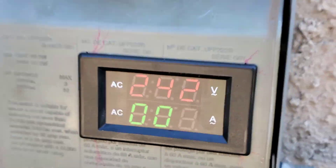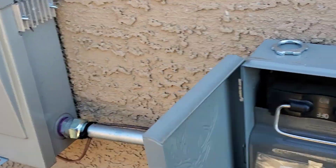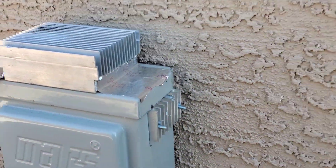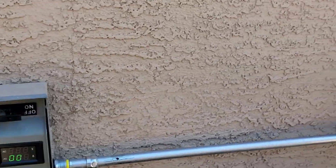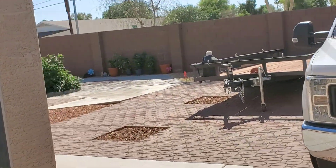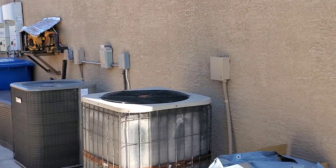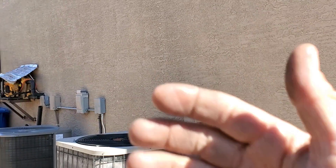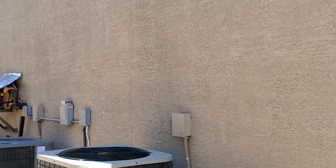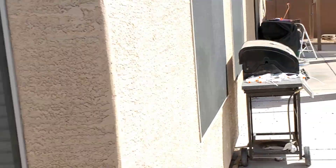The VFD is running the compressor on first stage - it's louder at 40 Hz than at 60 Hz. Plugging that back in, drops back to zero. Being on first stage with the sun still up this time of year and a mild day - only about 80 degrees - I'm not losing solar power due to temperature like I will in June. The sun's at a decent angle. I have a feeling if I grab my meter the DC voltage is going to be way up there, above 330 volts - the panels probably aren't using full 5,500 watts.